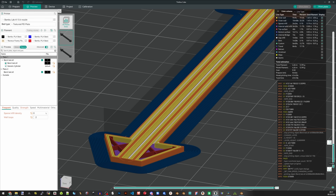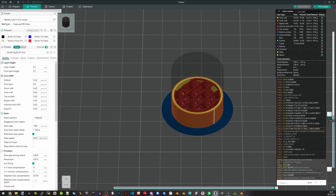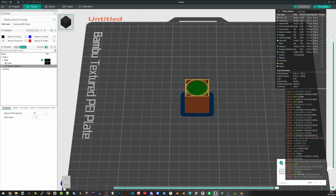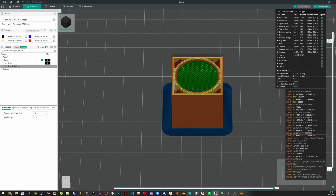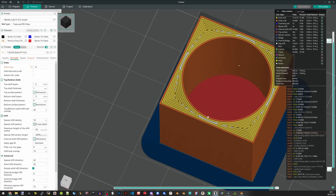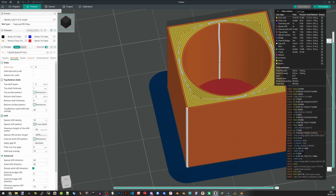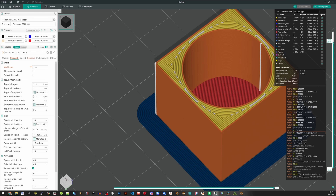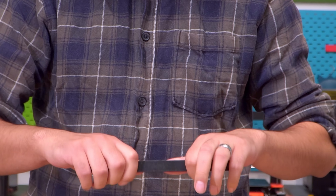Slicers optimize wall generation so they align with the outer wall, but also with any internal geometry. So if your part is curved, you'll have a curved path. With Arachne wall generation, gaps are less of a problem when doing this. While it would be cool to have a slicer curve perimeters anywhere there is a right angle between walls or walls on top and bottom infill, this isn't just about having a curved internal geometry — this is about putting the perimeters in the right place.